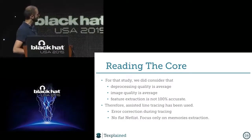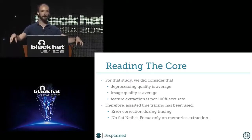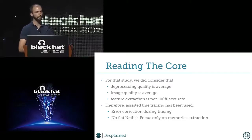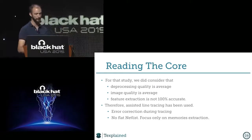All right, so we did what I called line tracing. It's like in Photoshop, but if you automate the task, it's a click on a line, and now you know where it's going. It's already connected to the standard cells and so on. It's building the graph, the Verilog file, and everything at the same time. So for you to look at the study, it's very comfortable. You don't spend a day to follow a single line. In a day, you follow everything.